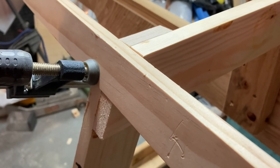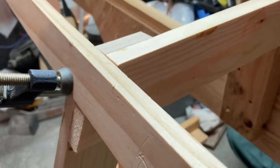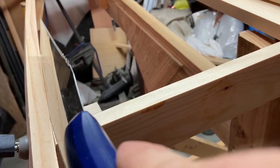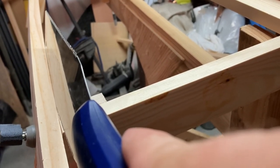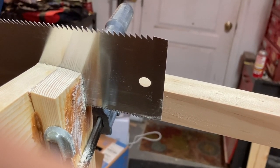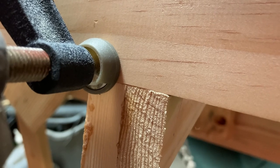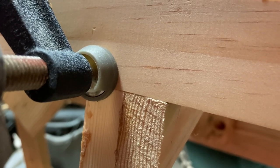When you're notching in chine logs, you can lightly clamp it. You can see there's a little step-off, so you can take a pull saw and line that up with the chine log. You can use that as a guide to help cut a nice perfect joint for where the frame rail meets the chine log — the whole saw will flex to the same angle as the chine log. You can fine tune that joint one thickness of the blade at a time. The end result of using that Japanese pull saw is you get a nice flush cut and a precise, tight joint. Rough it up a little bit so it'll ring for the epoxy to lay in there and it'll be super solid.